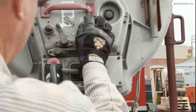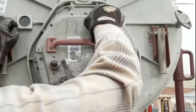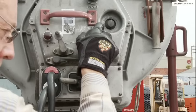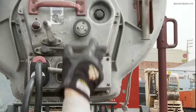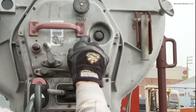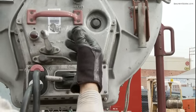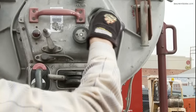Let's talk about the back of the unit. Up top we have the positive feed — it takes the carbon forward and back for the adjustment. Down here we have the negative feed, which takes care of the carbon going up and down. Everything is operated off the motor; sometimes it doesn't speed up as fast as you want and you have to crank it. There's also a little variac here — if the carbon is feeding too fast or too slow, you can vary the speed of the motor that operates the positive going in and out.